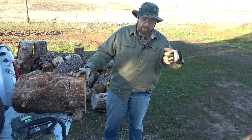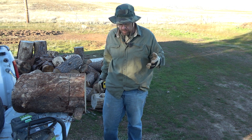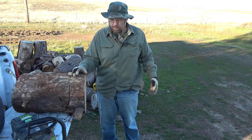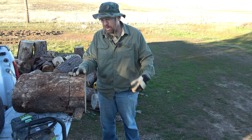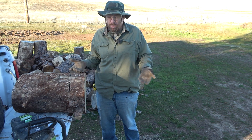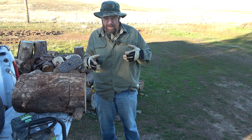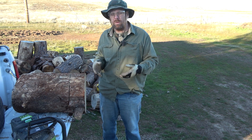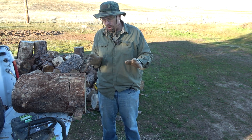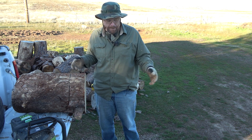As you can see, you can still get a reasonable amount of work done. I did this as a worst-case scenario — 12 inches is pretty thick timber for this chainsaw. If you're cutting 16-inch pieces and splitting them, you could probably cut close to maybe a quarter cord with something like this. I'm doing this more to check the number of slices, but again, this is an eight-year-old battery. Almost seven good clean cuts through a 12-inch round — that's kind of what I'd expect for what's become my backup battery.